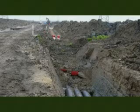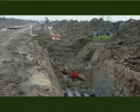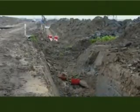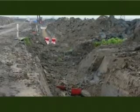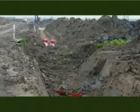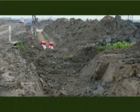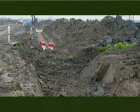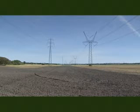After the cables have been laid and then covered with 10 centimetres of sand, empty pipes are laid for fibre optic cables, which will be used for communication purposes. Furthermore, marker tape and warning tape is laid. The cable trench is filled with the earth which was originally excavated. Insofar as possible, no earth is transported away, depending on the conditions at the individual sites. Damaged drains are re-established, and the entire exposed area is finally levelled.